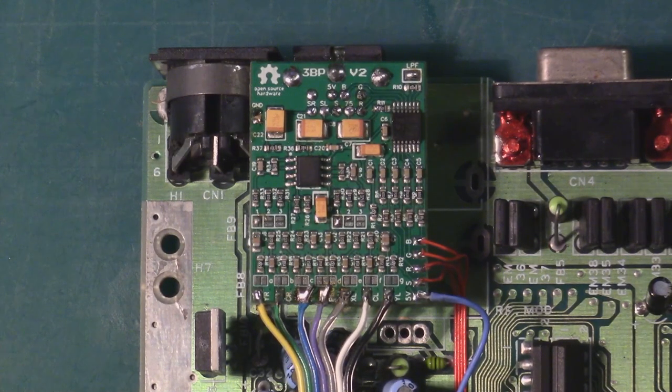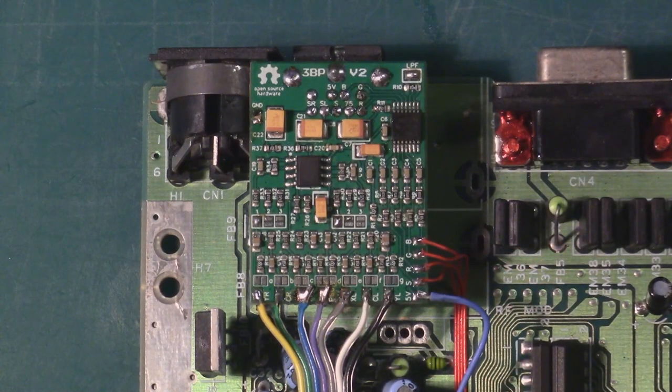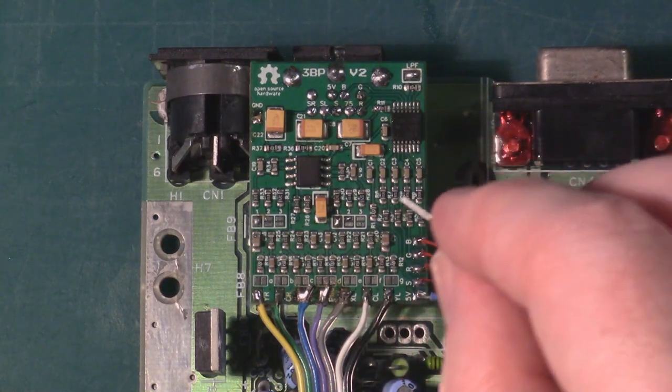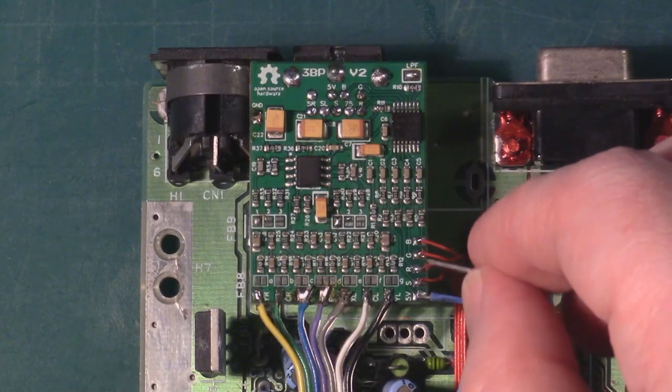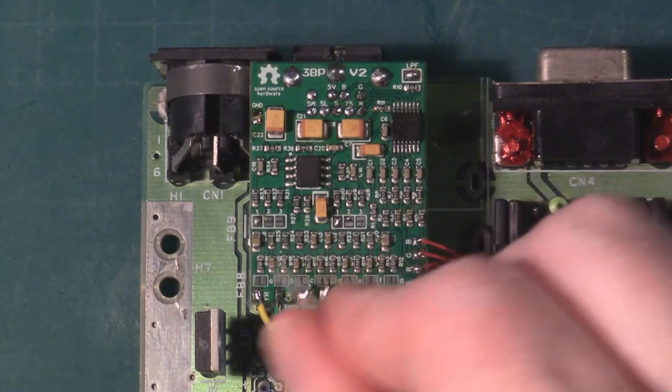But first I want to show you exactly how the picture is affected by not having the pull-ups, and it's in the middle ranges of color space. It's the curve, like a gradient. We'll capture that on the scope, and you'll see that the middle part of the gradient curve isn't great without those pull-ups. So this fix will reintroduce that smooth curve in the gradient.